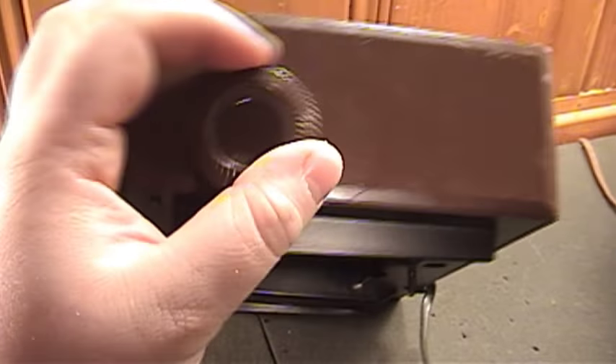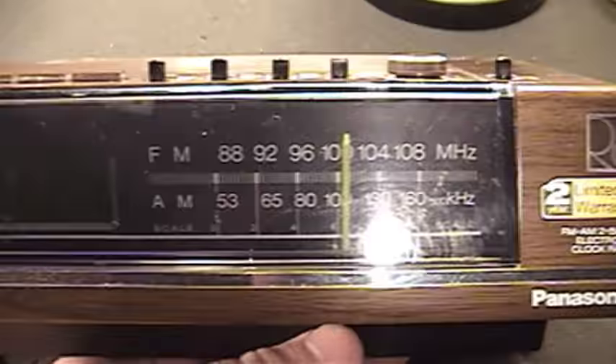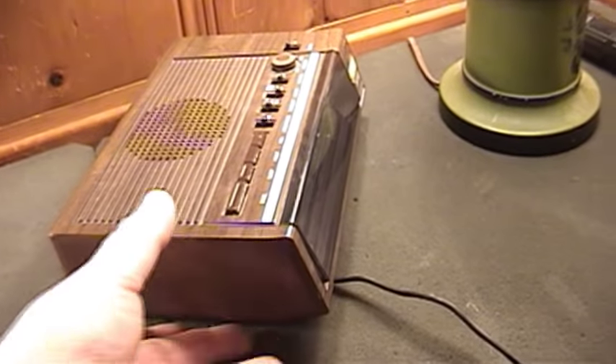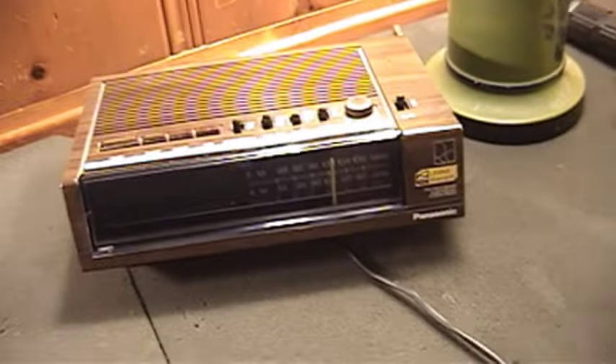There's really no way to wake exclusively to the buzzer unless you were to turn the volume down for the radio, which is done through this knob. There's a band selector switch, and a tuner knob on the right which is plastic and does feel quite flimsy — but that's to be expected with something this cheap. There is a tuning indicator for AM and FM that is actually in calibration somewhat, so you can get a fairly accurate depiction of which frequency you're tuned to. There's what looks to be a two-inch speaker, which really does let you down in the audio department. The plastic bezel appears to be coming loose — sounds like this thing has fallen at one time or another, with plastic rattling around on the inside.